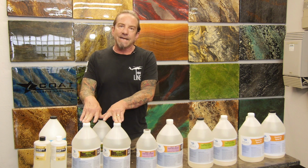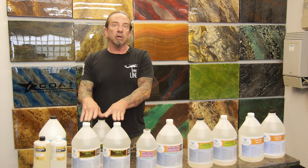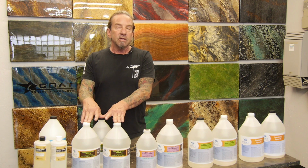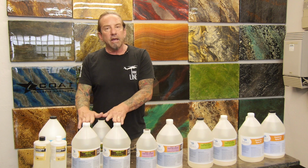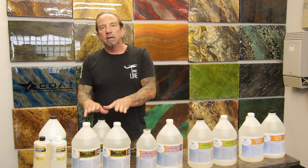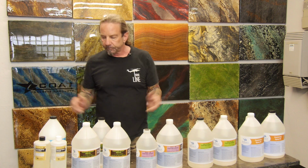This is our depth countertop system. This will be able to be poured in mass up to 4 inches, crystal clear epoxy, and it is very low heat, yet it can be demolded in 24 to 48 hours depending on the volume.